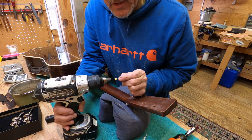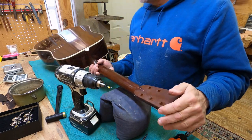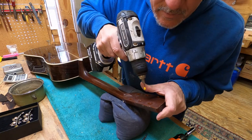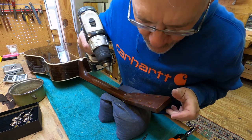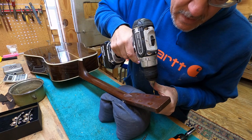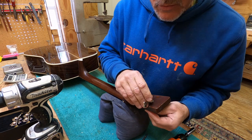Check it again with the drill bit - the point of that screw is still going to go into the wood. Here's my mark right there. Brace it with your thumb and go. Even though I have a depth stop on there, I still stop shy of that to keep it from getting bumped and sliding forward. Brace it with your thumb and stop just shy of it.